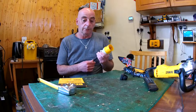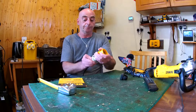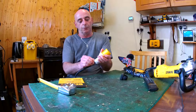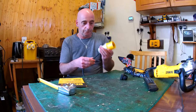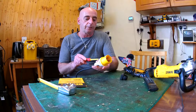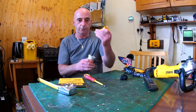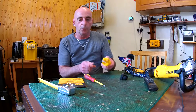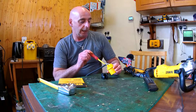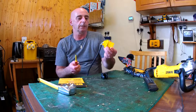What we've got to do is: we have a plug. Mine is already connected, so I'm going to reverse engineer it. The first thing is to unscrew this bit here. Remember, when you do yours the wire won't be attached. We then have to take this piece out of the inside, which is the water seal and the cable grip. There's a logo that says push down with a screwdriver, then turn it, and it comes to bits. Inside the UK 110 plugs there is a live, a neutral, and an earth. This one came with colour coding black and white instead of the red and blue we're used to.